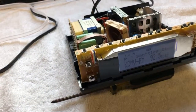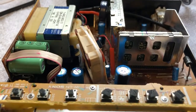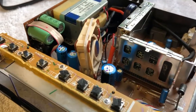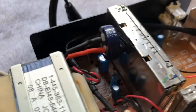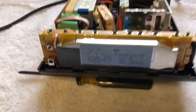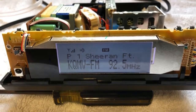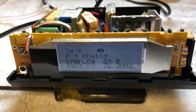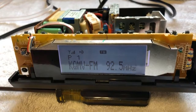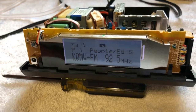Everything's mounted in there now and seems to be working great. The fan is Velcroed on the bottom, and I put a zip tie around it just to keep it from wiggling. The super cap is also mounted with a little bit of Velcro. We're going to button it all up and call it good. I will post in the description some links and the parts list that I used. Hopefully some of you find this to be useful — simple modifications to improve the cooling and backup memory retention for your Sony XDR-F1 HD radio.